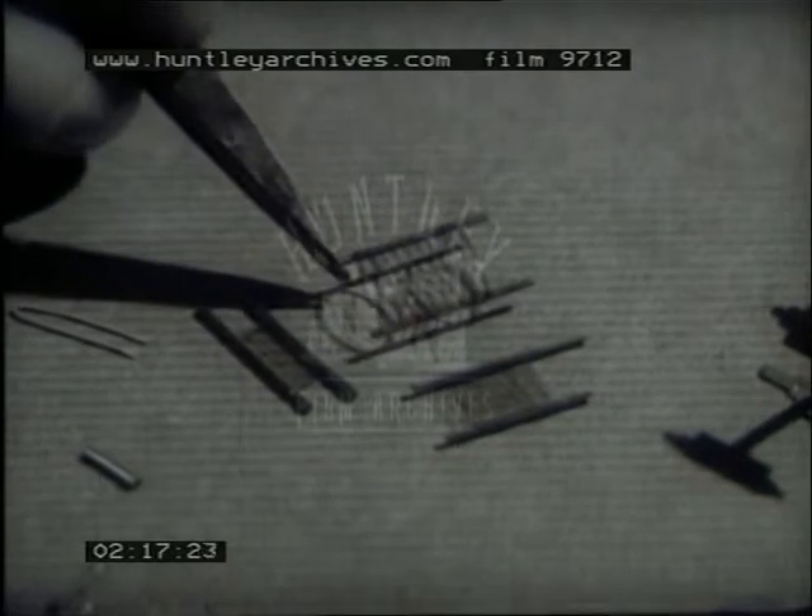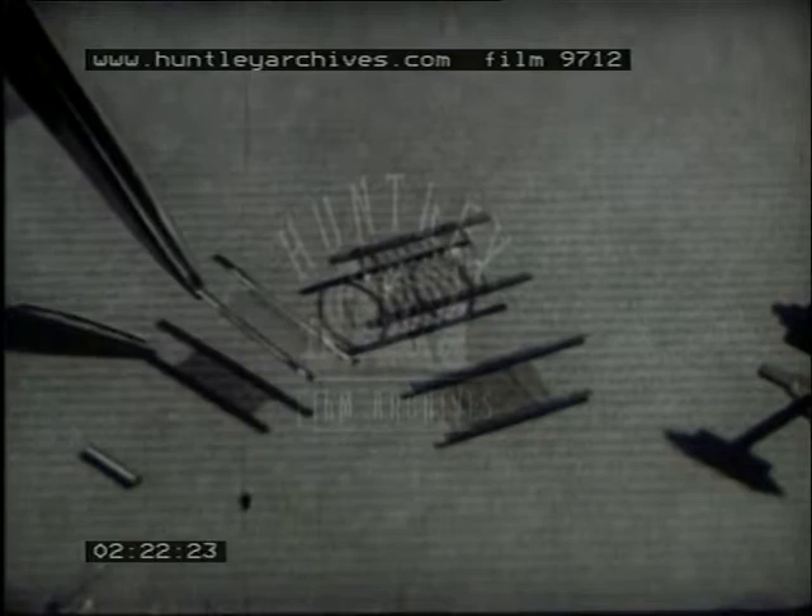These are typical grids — flattened spirals of fine molybdenum wire, wound on two stout backbone wires. In the pentode type of valve, there are three grids.